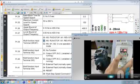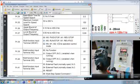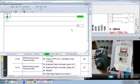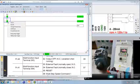So at 38, I'm going to enter 01. Alright, this is parameter frequency 5.8. Now let's see the change in the operation. Now when I run M30, this is running, and the direction by default is forward. This is forward. If I run M31 along, now it will run reverse. It will stop and run reverse.